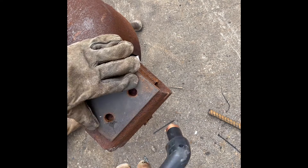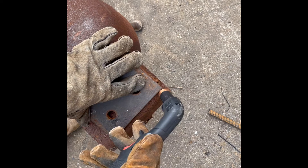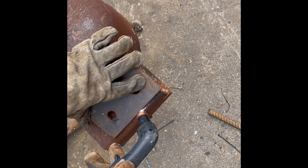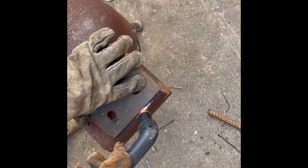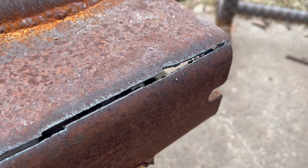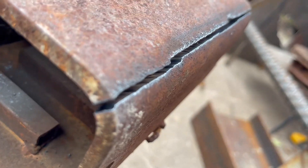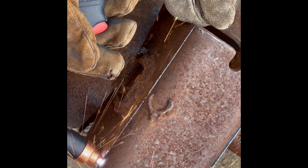This plate is actually a quarter wall, so it's a quarter inch thick. I have a drag plate on it so I can come in contact with the metal. I did get snagged on the rust here, so my cuts aren't beautiful, but you'll get the point. I'm using this side plate just to make sure my lines are straight. This next cut I'm just going to freehand — comes out a lot better.